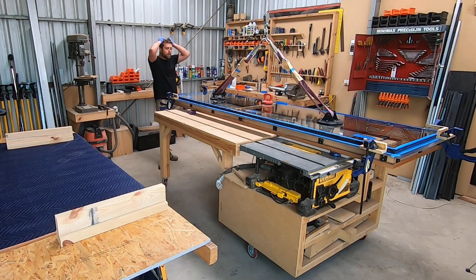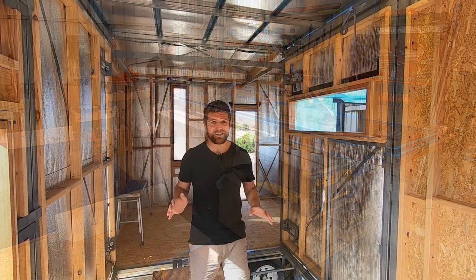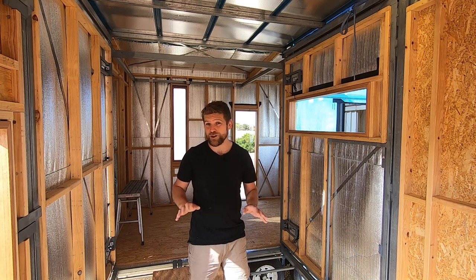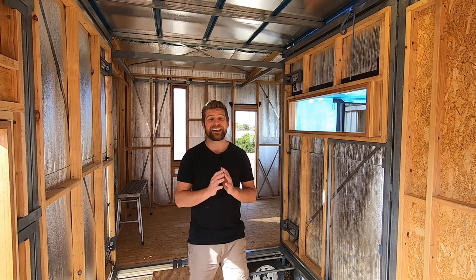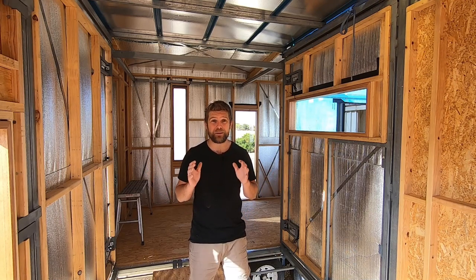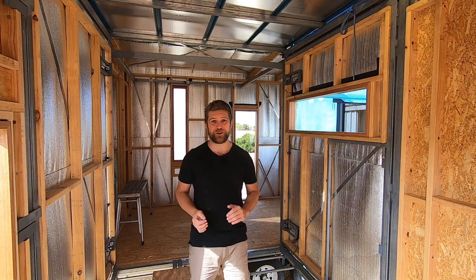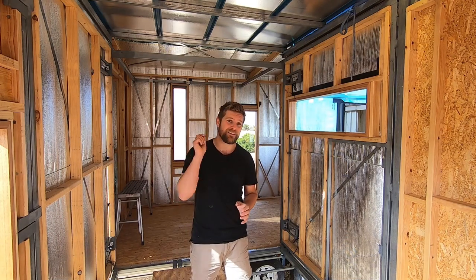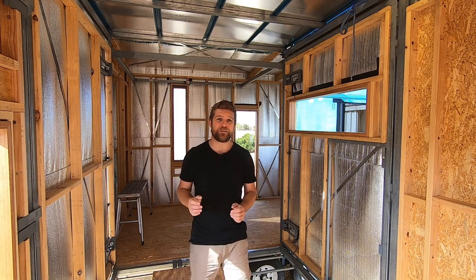So to rectify that, I had to pull the glass off. I had to clean everything back to bare material. And because it's silicone based, there can't be any residue, and I had to make sure I don't get any solvent or residue across the glass that's gonna affect the clarity of the glass. So I had to clean everything back to scratch. I then had to dismantle the kitchen window and rebuild it 10 mils smaller. Luckily, it was the one window I could actually shorten a little bit. I rebuilt it, and then stuck the glass for a second time. And then I had to let that cure, and I got that in just before Christmas.